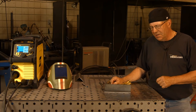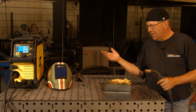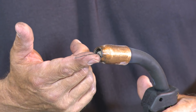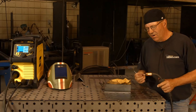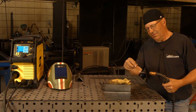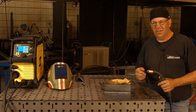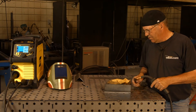Another thing I want to explain about MIG welding — gas metal arc welding — regardless of what wire, but especially with this gasless flux core wire, is drive roll tension. This wire feeds out pretty nicely and smooth. Correct drive roll tension means I can stop this wire with my finger. If you're running too much drive roll pressure, you can actually collapse the wire and it comes out with a pigtail, swirling around — you're distorting the integrity of the wire. You can back it off quite a ways and it'll still feed smooth, but if you can stop it with your finger, you're just right.